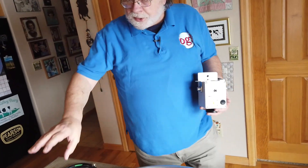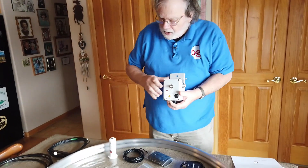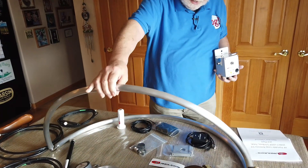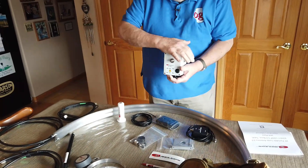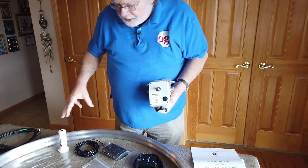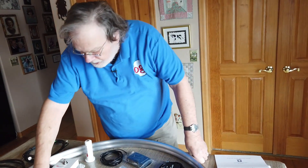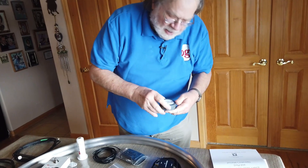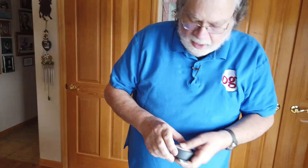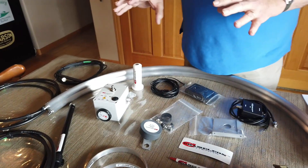You can use these with the SO239, or you can use these, which have even less resistance in the skin resistance. They also offer a version that's a little bit easier to tune. With all of them, they offer the so-called power compensator. This is a reactive element — it's a capacitance. And if you connect this on here, you'll find you can put a lot more power through.